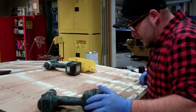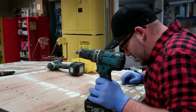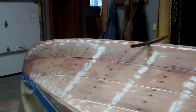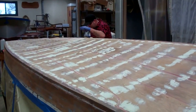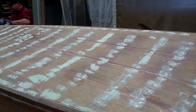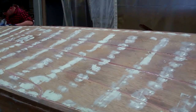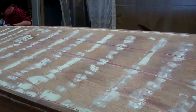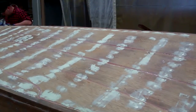Once Joe and RJ have set each of these battens and completed their work on the port side of the bottom, then it's my turn for the other disagreeable part of this process, which is filling every one of these countersinks with 3M premium marine filler. You can see I've started working on the port side of the bottom. I go through three times, and after the first application I hit the whole bottom with 80 grit on a Festool orbital sander, vacuum it all off, and blow it out with an air gun.